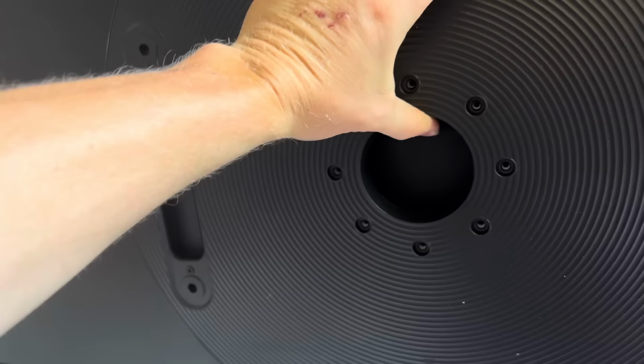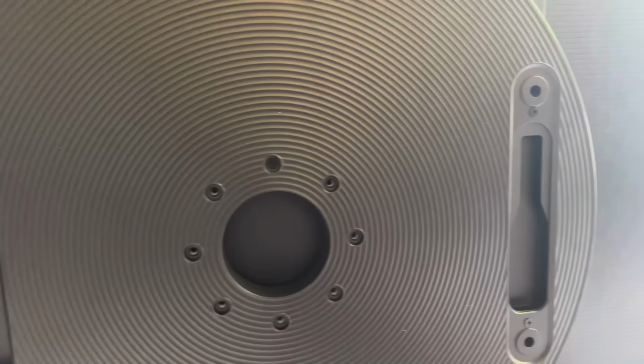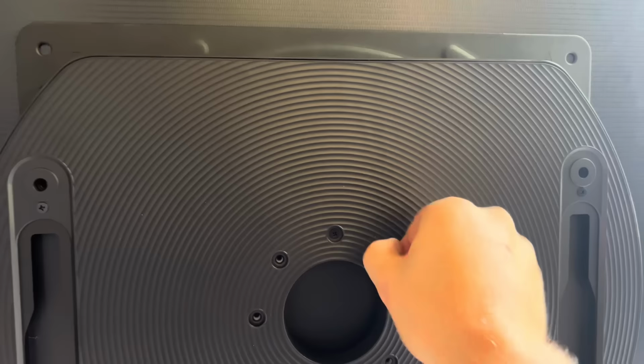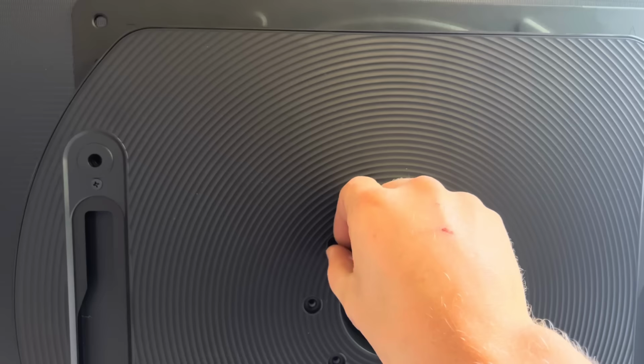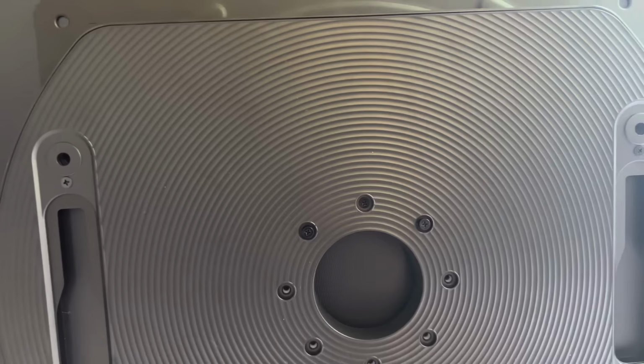Other than that, make sure you come over here. You'll see the H-pack, there's 8 screws in here. We're gonna take this, I'm gonna slide this onto those on here. You'll see the line up, and then put in those 8 screws. Again, you're gonna feel it sink on there and it'll fit in the grooves. Don't try to force it, it's very, very smooth. And then if you want to, go ahead and just preload all the screws, just like I'm doing now, and go ahead and tighten them in. I would personally do them by hand just because I know that it's probably not the strongest metal. I wouldn't use an impact, but if you want to, be very gentle.